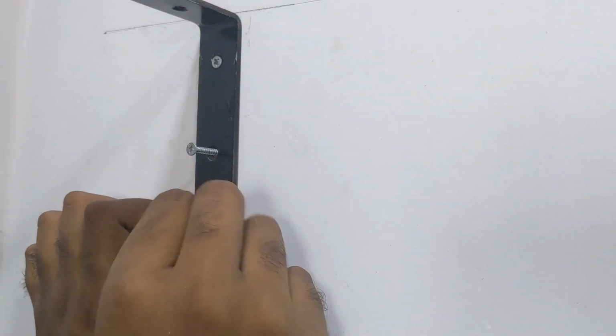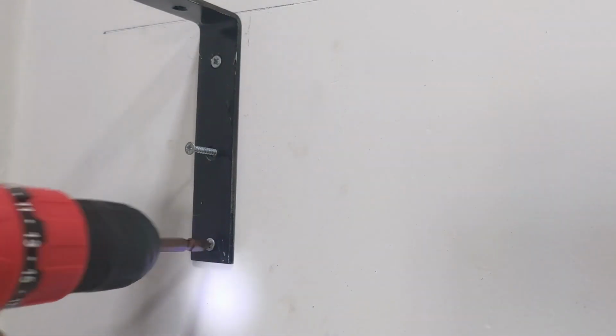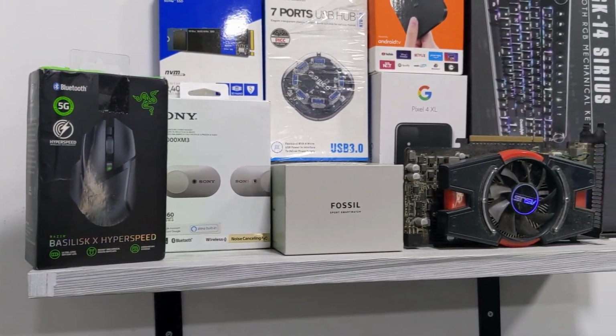I've set up the wall brackets to be 4 inches inset from the edge of the shelves to allow for a little overhang. Now similarly, I'll secure the other bracket parallel to it and fasten the shelf on top of it. With that, here's some B-roll.